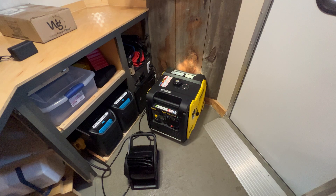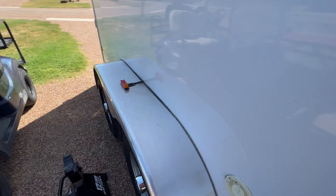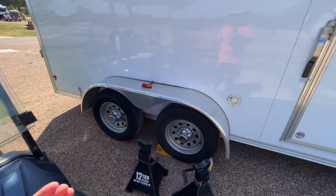That is really the most pressing issue I have right now — it's just too hot to work out here. In theory, each one of these tanks will give me 14 hours of run time on the generator, giving me a couple days of run time without having to deal with gasoline. One of the main reasons I want to run off propane is I know there will be times where I don't use the generator for two or three months at a time, and I'd rather not have gas sitting in it or have to keep gas cans inside the trailer. Propane seems to be much cleaner running — it doesn't cause as much carbon deposit in the generator and it extends the life of the oil.